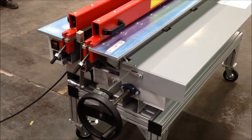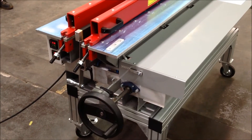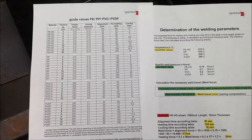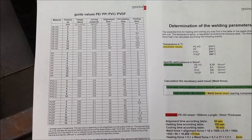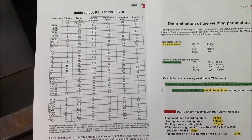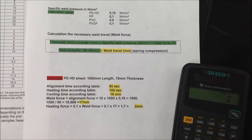Now we are going to show the operation of the S-Hand butt welding machine — in this case the 1.5 meter machine. The first thing we need to do in order to weld correctly according to DVS is to find out what kind of material you are using, what thickness, what length, and then you need to do a simple calculation in order to have the right welding force.